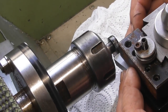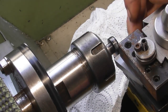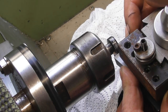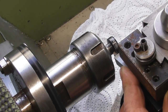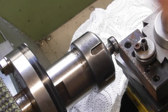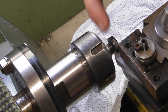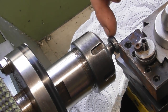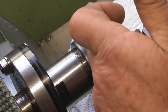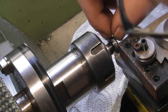I've got a little straight knife-edged right-handed tool. I've taken the compound off, put my fixed block back up with my quick change tool post, and I'm just going to set the base of that tool to the angle of the base. I've set the height of the tool and I now know I've got the correct angle. I've used the existing part to match up the angle of the tool approach with where it should be, so I can simply switch over to the new parts, touch in the bottom corner, and machine that back until the bottom corner touches.